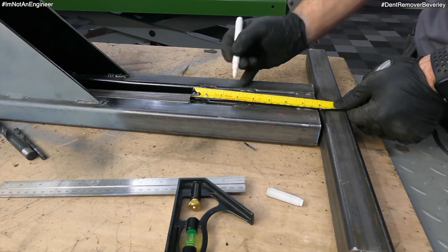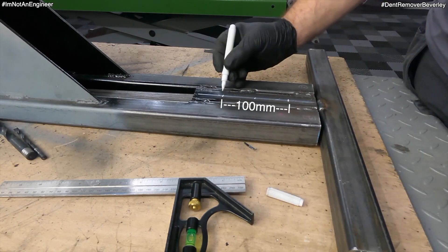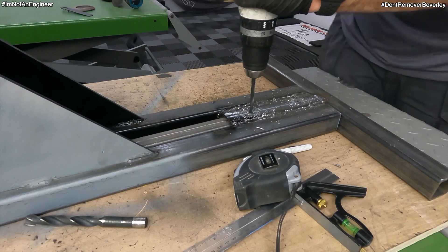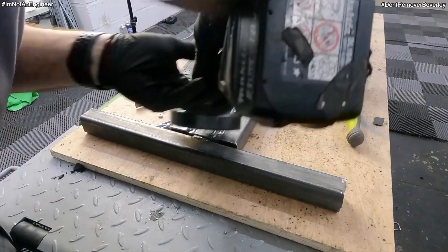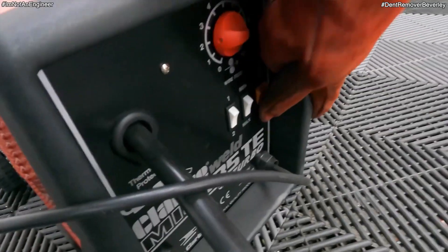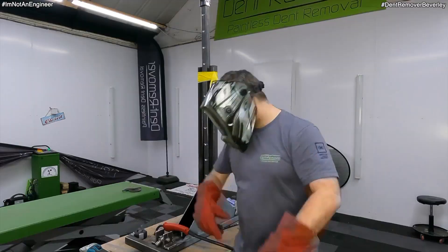Because I've made these feet totally retractable I need to be able to lock them in place. So to do this I'm drilling two holes 100mm apart and then drilling locking holes into the feet every 100mm. For the locking pins I'm using a 10mm nut and bolt, welding the nut to the base, and then with the 10mm bolts I can screw them down into the feet to hold them and stop them from moving.